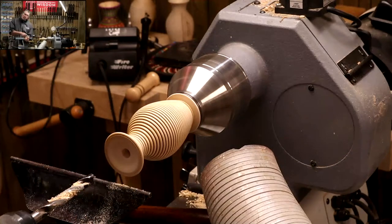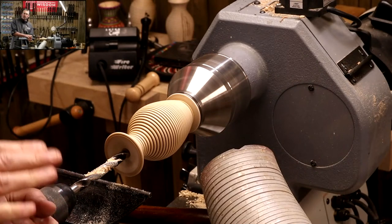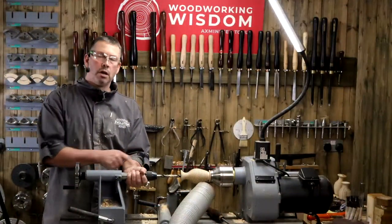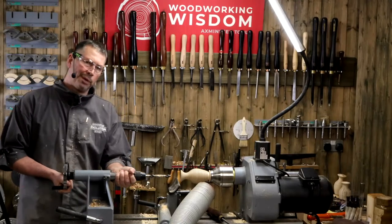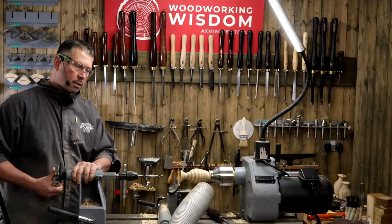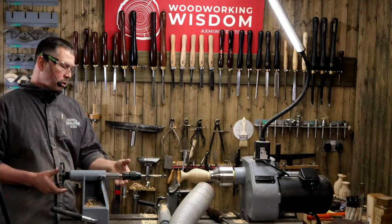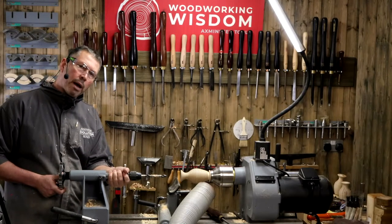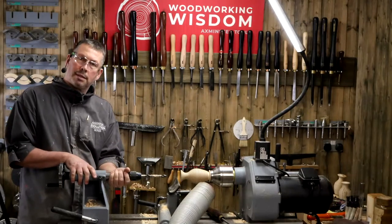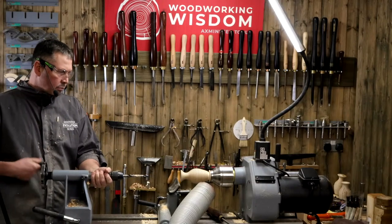There we are. My hand, I don't know whether that's visible anywhere, Ben. My hand, no, it's not. Go to camera one. My hand has not left the drill chuck. So whilst I'm pushing that in, pulling it out, I've got a hand on the drill chuck. I don't want to suddenly find that drill chuck spinning around 100 miles an hour and flying off somewhere. So I've just kept my hand there to stop that from happening, all right? Worst case scenario, you detect it when it starts to slip, so you stop your actions. So that's the reason my hand was there all the time. Yes, Ben?